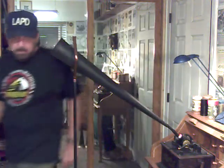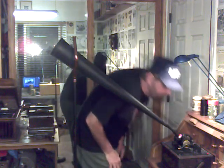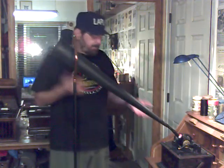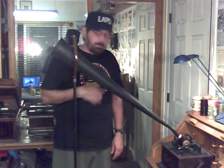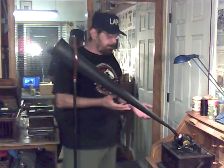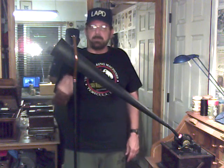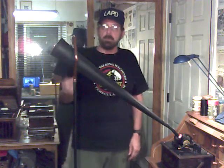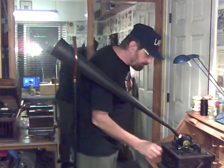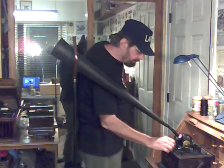The machine is wound and I'm recording on the Standard B. I've shaved and trimmed an Edison Ediphone black wax cylinder and installed the Canaphonic voice recorder. The nice thing about the voice recorder is you don't have to yell — I can talk in a normal tone of voice. With a recording horn, you can speak a bit louder. With an Edison recorder, you have to yell into it, but with the Canaphonic voice recorder you don't. The recording should still be crisp, clear, and bright, but much deeper and fuller because the recording horn captures more of the longer waves. Machine's up to speed — as soon as I drop the stylus, the recording will begin.